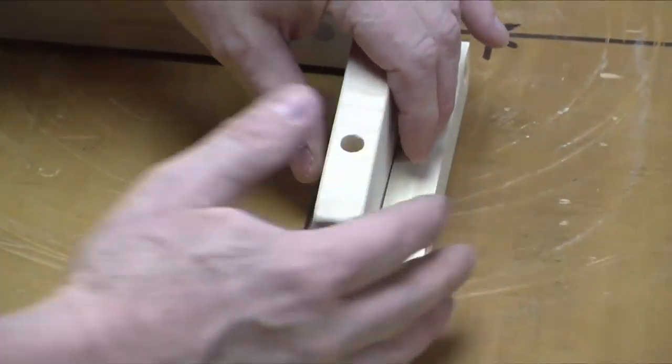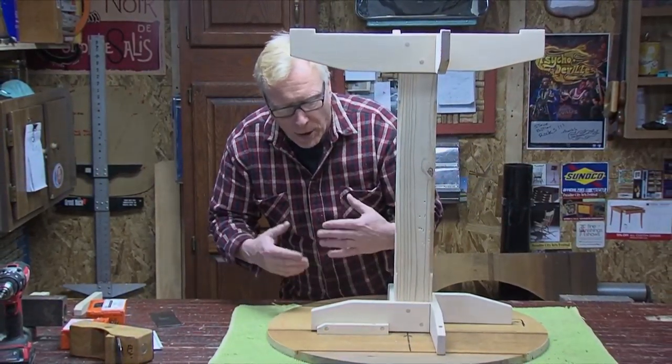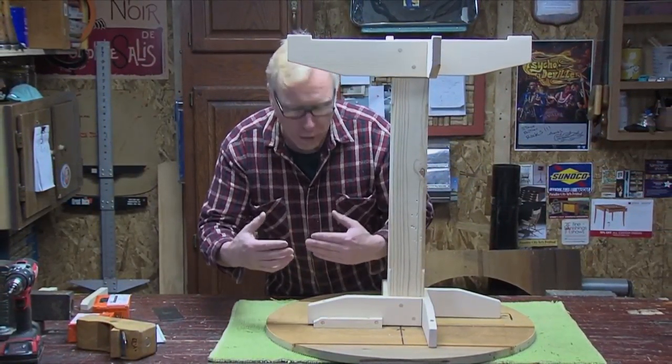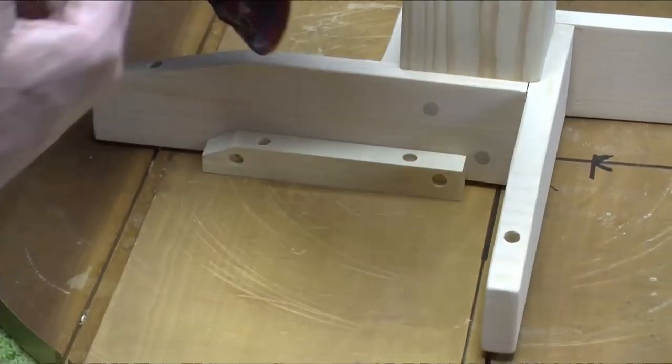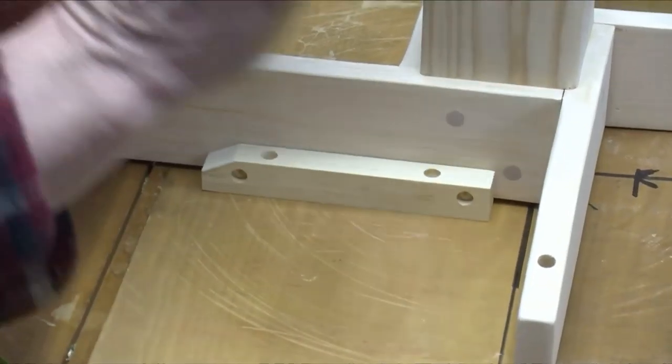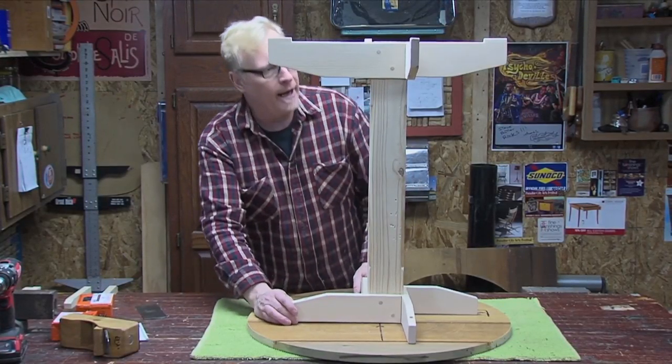And it's going in the same direction as the grain. So when this table, I mean, this is pretty stable. It's really old. But when it expands and contracts, it'll move with it. If I'm putting it on the other side of the grain, you should elongate the holes so the screw has room to move when the tabletop expands and contracts.